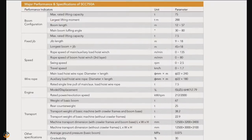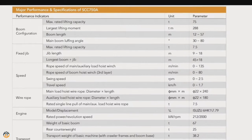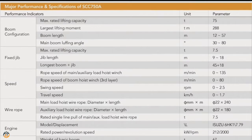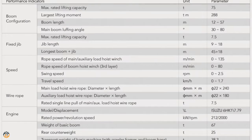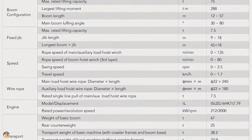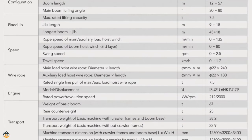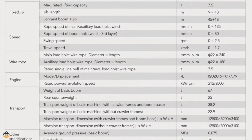As of now, I showed you each component of the machine. In the next video, I'll show you the theoretical parameters and performance of this SCC750A. Next, I'll show you the main performance and specification of this crane. Here you can see maximum rated capacity. Capacity is 75 ton, and largest lifting moment, 288. And the main boom configuration, fixed jib. The speed, wire rope, engine details, equipment, transportation dimensions and other details.